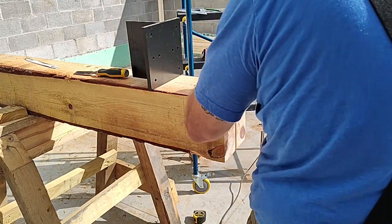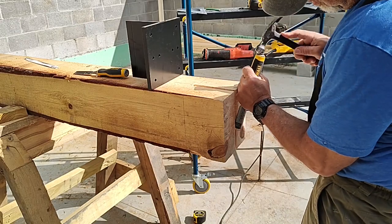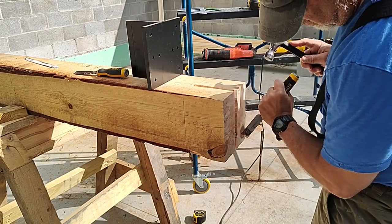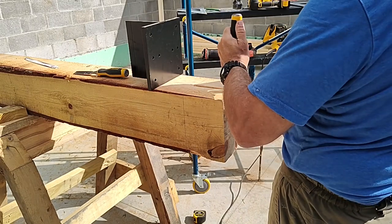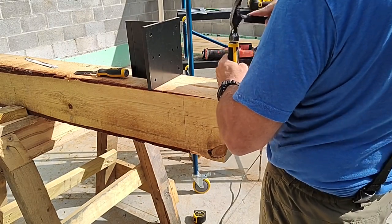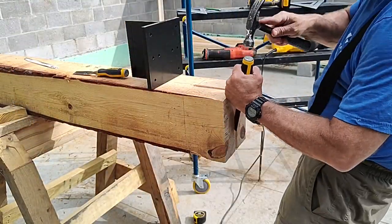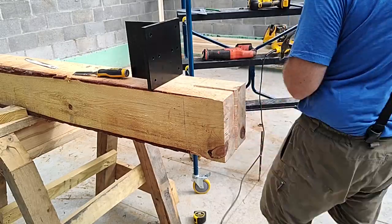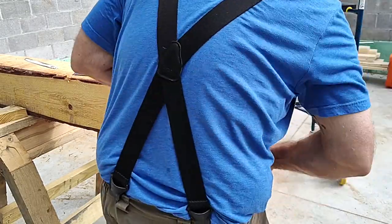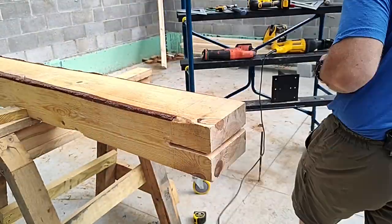Here the knife plate swoops down into the horizontal, so it's a little fatter than a quarter inch at the curve. What I'm doing is chamfering off the corners on both inside corners that'll sit on the knife plate, which allows for the curvature of the way the knife plate goes into the base. I certainly could have saved some time if I had all the right tools on hand — it reinforces the need to keep more stuff in my truck.